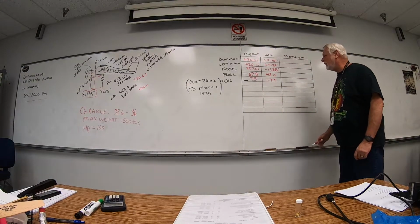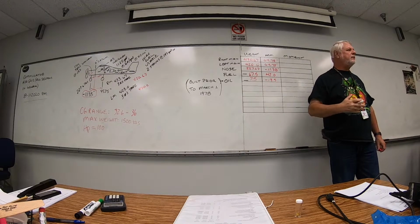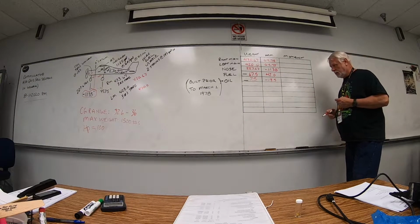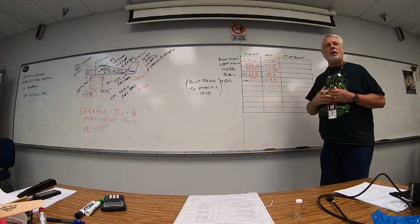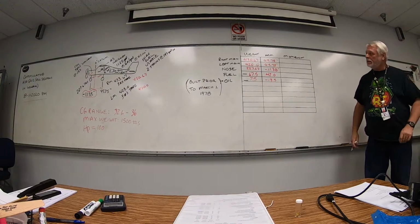So this is what we need to do to calculate our empty weight. Now we're also going to do an adverse weight check. Not that I believe your DME would ever test you on that, but he might. Let's get prepared for it. Let's do that here in a minute. So, right here, let's go ahead and get our moments. Weight times arm equals moment. You've probably heard that. I know my class has heard it how many times? 1.5 million probably by now.